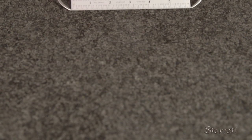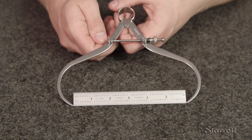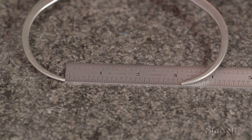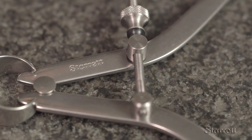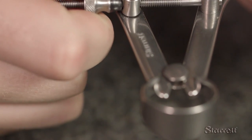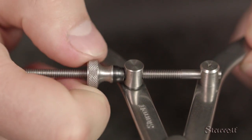The capacity of the 79A-6 is about 6 inches or 150 millimeters. The most common job for this tool is to measure the width of a part feature, then move the set caliper to a steel rule to measure the dimension. The 79A-6 can be very accurate, but it requires precise touch and feel. You will need some time and experience to make this tool really work for you.